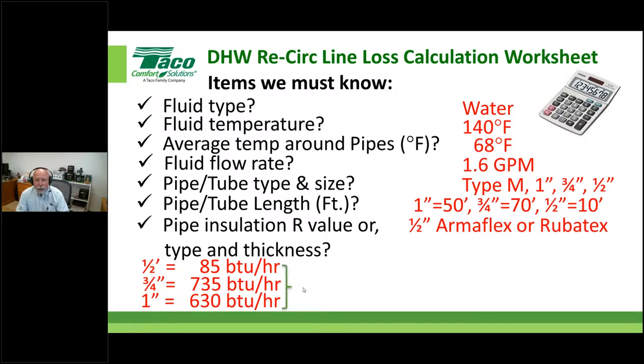You just carry that over into a number, right? All we're really doing, you'll see this as I finish this slide, is making sure that our maximum velocity limitation number in GPM well exceeds the minimum that's required, right? Remember what I said, you design around minimum, that forces you to run that pump 24/7. That's not a very good control strategy. We frown on that in our industry, okay?